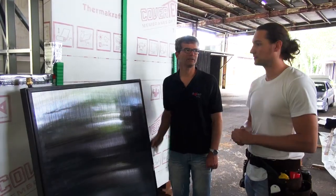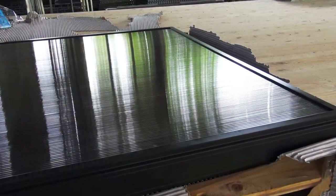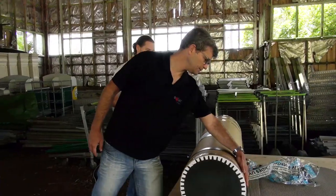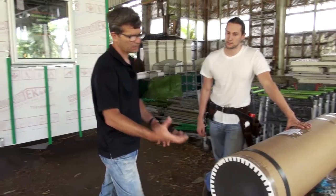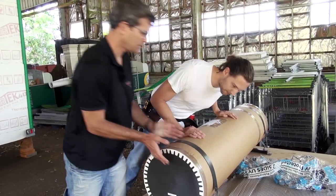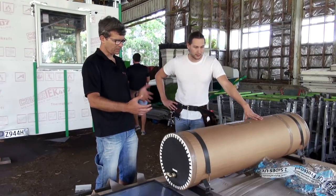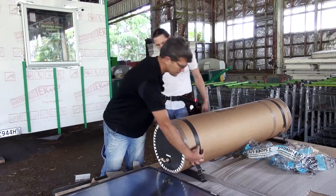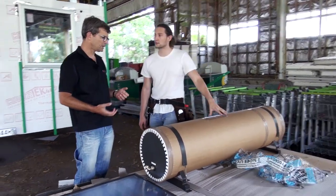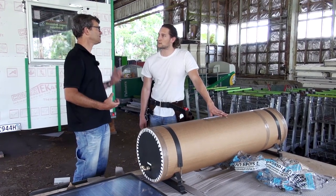Obviously this panel is super light compared to other solar panels we make, and you can see it can be lifted easily — it's probably less than 10 kg all up. The tank itself is strapped and these straps are actually far beyond what you do in a normal residential house. In a normal residential house you will have straps that are much smaller and slimmer than this one. The bracket here is very massive. This is only a 90 litre tank and when it's empty the weight of it is quite insignificant, but because we thought about the fact that the whole thing is moving, we enhanced it with extra strength. The way we're going to anchor it to the roof, instead of using normal tech screws or other fixing material, we are looking to use a full nut bolt kind of system that can't really rip itself off the roof.